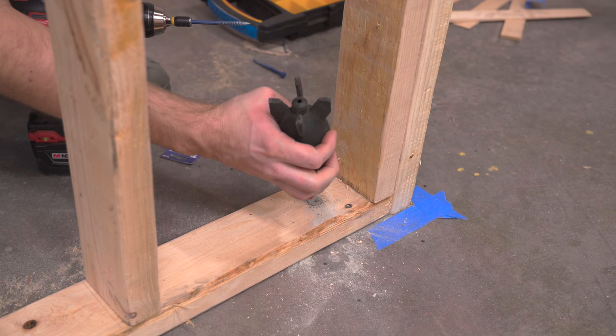Something exciting is the lighting I figured out for this space. I was looking into recessed cans and all sorts of things that would require a bunch of electrical work, but I found a perfect solution: construction string lights — basically five super-bright LEDs on an extension cord. They saved me a ton of time on wiring. They already come with carabiners so they hook up to the ceiling — just a couple of screw eyes and some zip ties and they were ready to go. To complete the kit I found a remote switch with a receiver that plugs into the wall and a switch you can mount anywhere to turn the lights on and off.